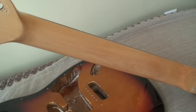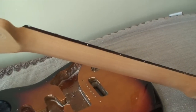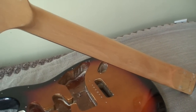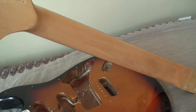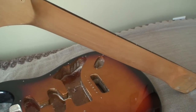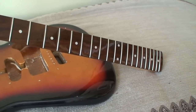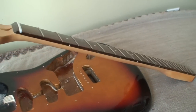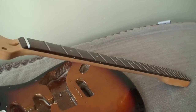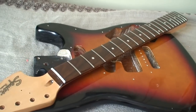This next part is definitely going to be useful as far as finishing techniques go, and it's certainly going to be less trouble — the weather won't be a problem because I can do all of it inside. The back comes right down to bare wood except for the rosewood on the fingerboard, and then I'm going to finish it in something smooth and slick that feels nice to the touch, because lacquered necks tend to get sticky. I'd like a nice smooth oil finish that doesn't stick to the palm of my hand. That'll be the next step, and as it turns out I'm sort of building my ideal neck here.